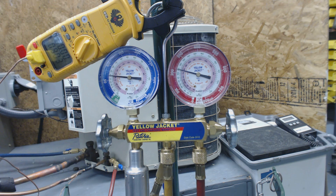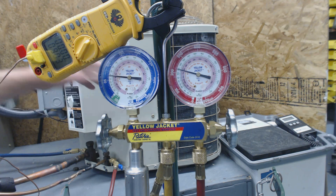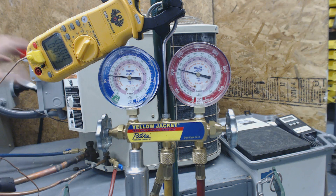What's going to happen with too much sub-cooling is the unit will run less efficiently, you're going to be drawing more amperage for your outdoor unit, your TXV may hunt a little bit - just not as bad as you would with low superheat - but it will work for the most part. You're going to be paying too much for electricity, and it's not doing the compressor any favors.